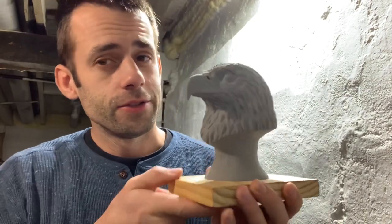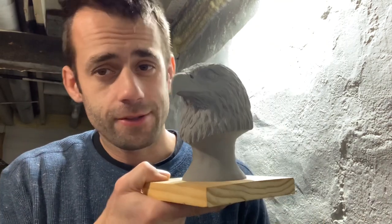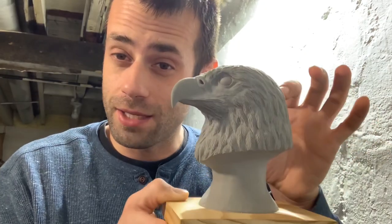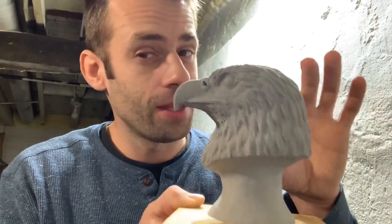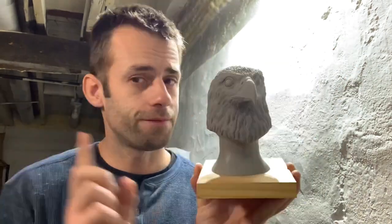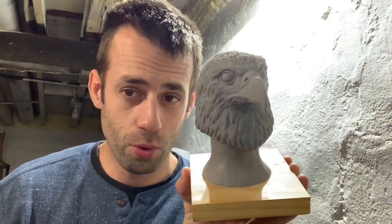Good day everyone. You guys voted and seem to want me to turn this into bronze, so we're gonna get started on making the mold. Just to tell you how amazing the internet is — I just got off a video chat with a guy named Dave over in Ireland. He's got a lot more experience with making molds than I do and he walked me through the whole process. I'm gonna do my best to make a skin mold with a plaster backer — it's a technique I haven't done yet but it's the right technique for this. First thing I'm gonna do, I need a bigger board for the base.